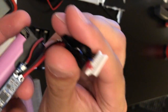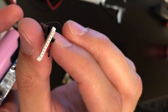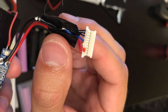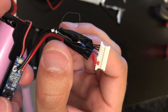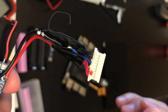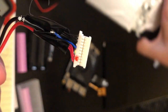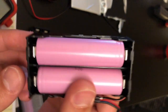The unique component here is the PanelMate Molex connector on top — it's 10 pins with a pitch of 1.25 millimeters. You can't buy a connector with the wires outright, though places like DigiKey do sell the individual components to make this. I may end up buying some of these to make available if people are interested. Unfortunately, I didn't make this one — I actually took it from another battery pack. But if people are interested, leave a comment below.